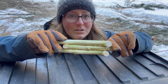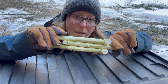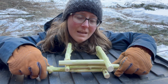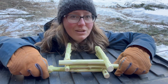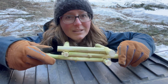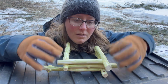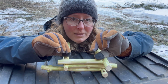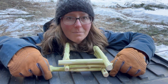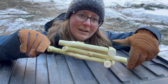You have to do a lot more measuring. It takes a lot more time to cut and shape the logs and make sure they fit together right. And then you have to wait to do some of the work in the house because the logs will settle. And since they're all shrinking and they all settle, you end up with a big gap at the top that you have to do something with after some time passes. So in a nutshell, that's the butt and pass style of house.